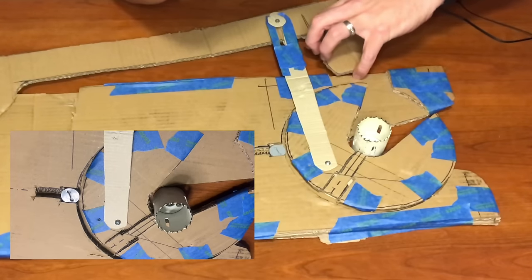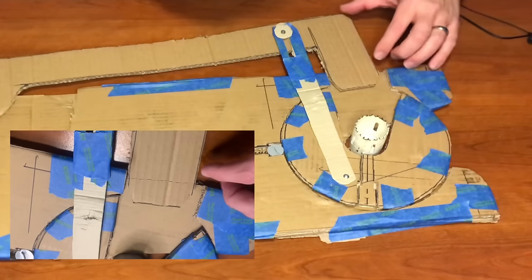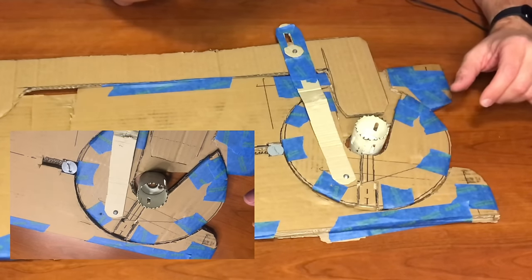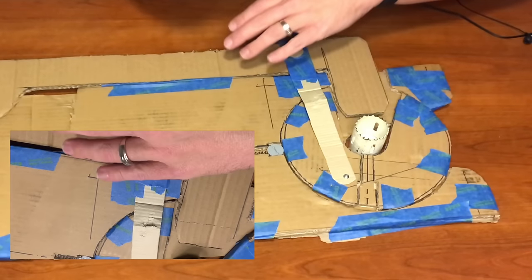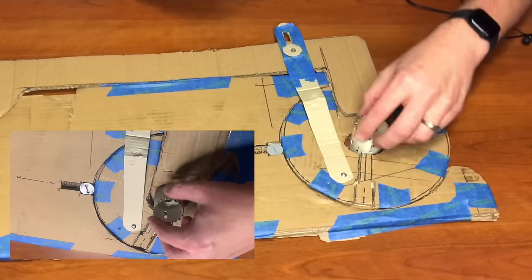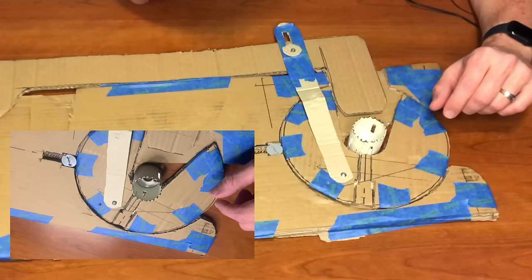Now, at the same time, my awesome cardboard model here, at the same time it rotates down, you now have the hammer, because it will stop right about there, and the hammer will finish and drop in the rest of the way. Now, this is a really cool design. Vekoma did an amazing job when they did this, because right now, the hammer assembly has a lot of weight to it. I mean, this is all big, solid stock bar, so the thing's really heavy. That hammer has now essentially locked the jaw in the shut position. Now that axle is stuck inside of there. It can't go anywhere. So now once the jaw is locked on, the catch wagon is free to start lifting.